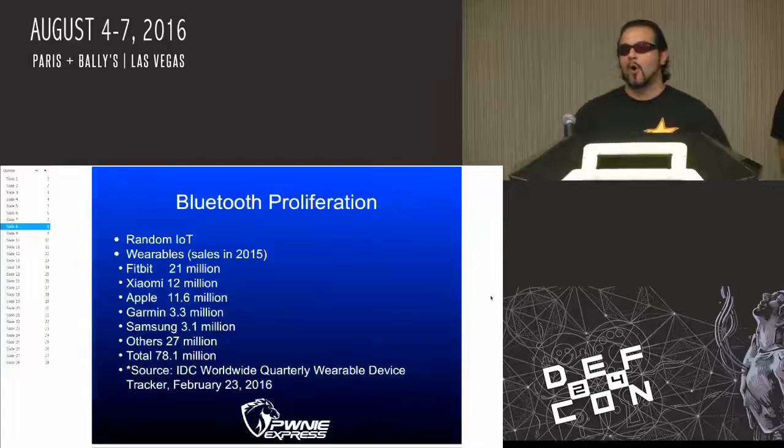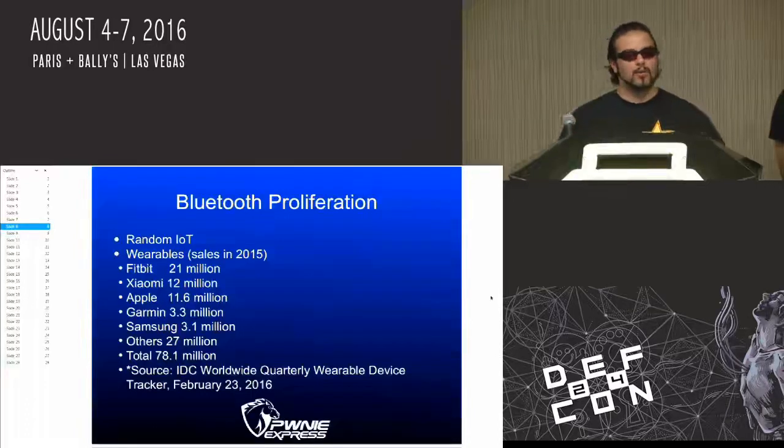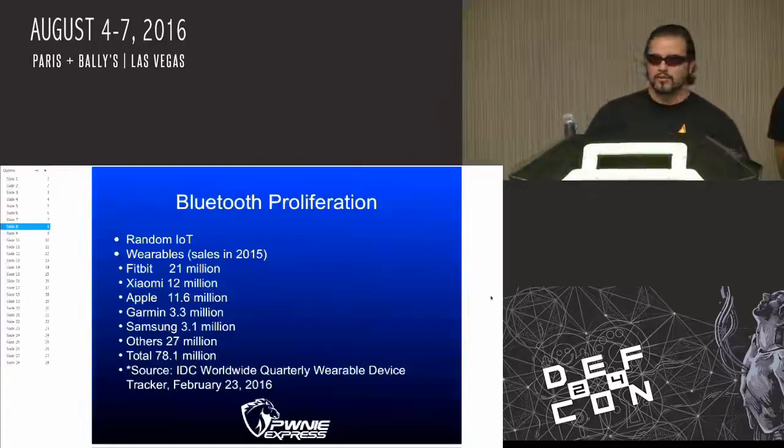Wearable stuff all around you. Bluetooth low energy, which was also called Bluetooth Smart, although it is not actually lower power transmit and receive, it's designed to be lower power consumption. It's trying to do deep sleep cycles and things like that to avoid burning all that power. So all of the wearable devices, the smart watches, the fitness trackers, they try to do that.